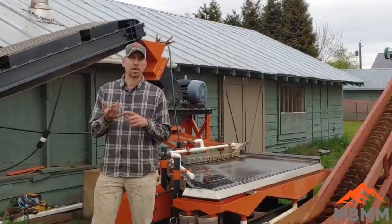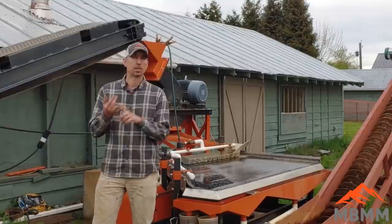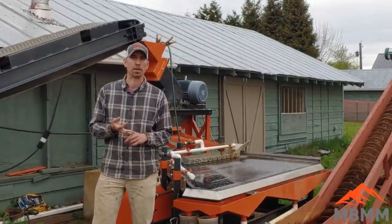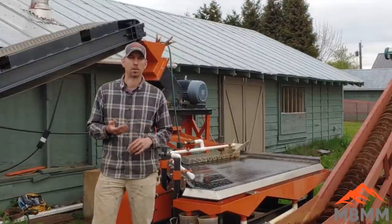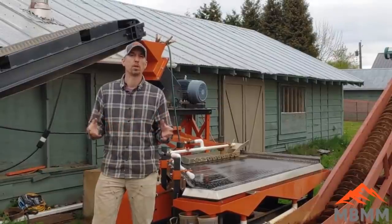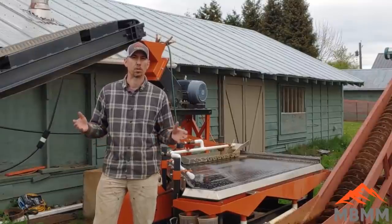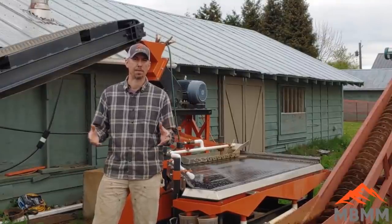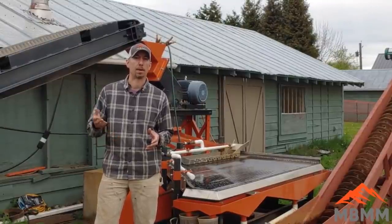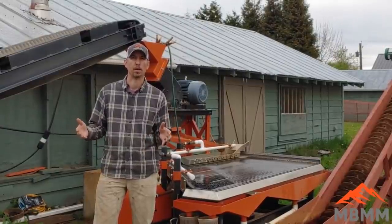The system costs about $50 a ton to operate. You're gonna need an excavator or loader. Let's put $50 a ton on that, and then an extra $50 a ton just for being conservative. So you're about $200 a ton to operate. And let's say we operate for 8 hours a day. So those are our costs for 8 hours a day. That ends up being right around $1,500. At 90 grams of gold recovered a day, that's about $4,500. So you're looking at about a $3,000 spread there.